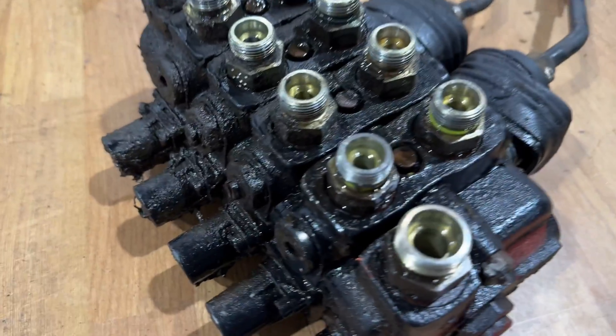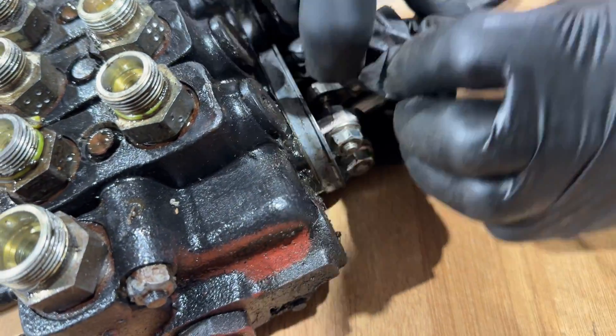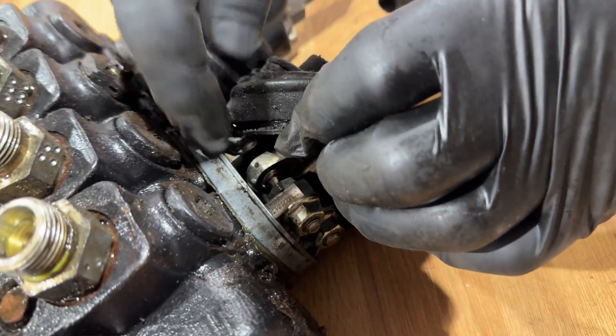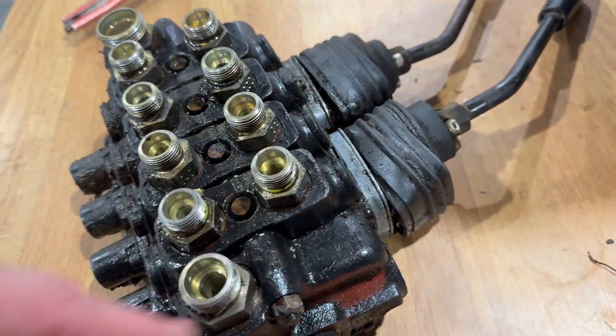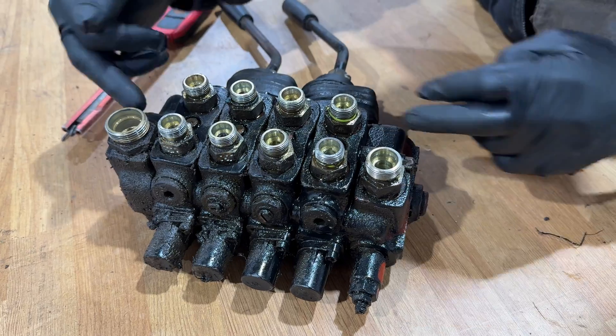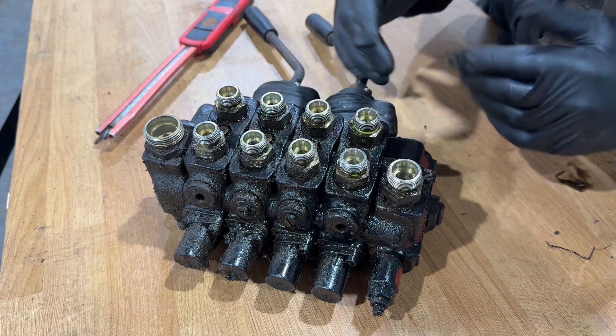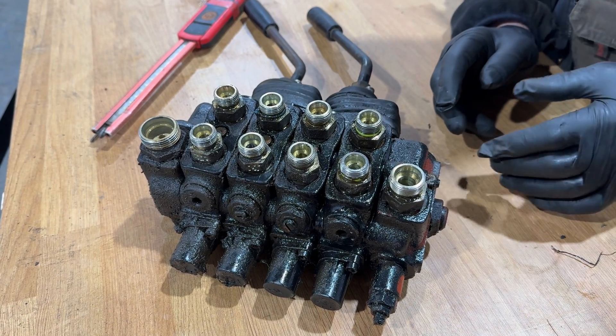So here's the block — looking rather grim and oily. What's the prognosis, Mike? Well, I'd probably say it's leaking out through the end of the spools — you can see it's quite oily in there and then it's just spreading out and dripping down, and that's where your leak's coming from. So there's no leaks on the pipes? No, not on the pipes. But whilst you're in there you might as well change the seals. It's a bankable block — you've got three long studs that go through there, and in between each of these there'll be O-rings and seals of various descriptions. So you might as well change the lot whilst you're in there.